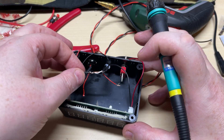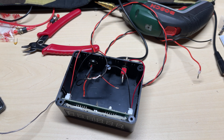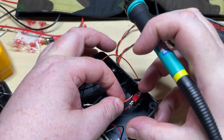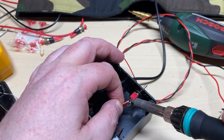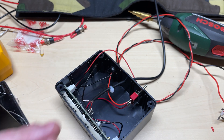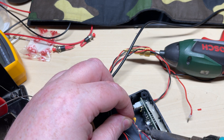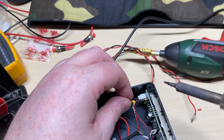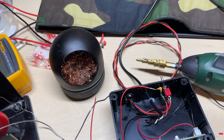The last thing we need is the lead to plug into the frequency counter — it's just a normal headphone plug. I've connected the wires together to make the headphone plug mono. We start off by connecting the power, and then I want to put a capacitor in line with the signal, because I don't know how well this frequency counter module takes the signal, so I'll just put a capacitor in line to isolate it anyway.